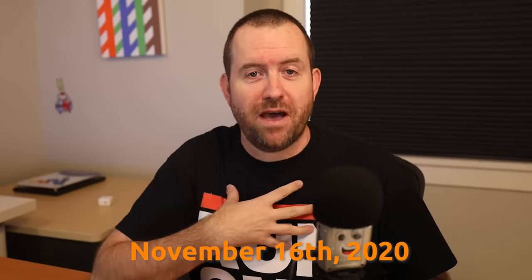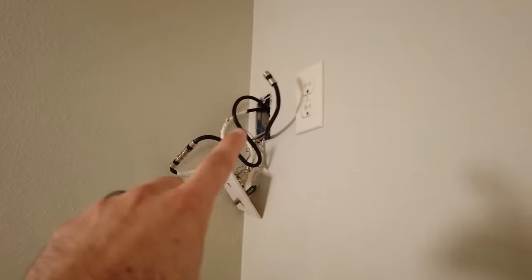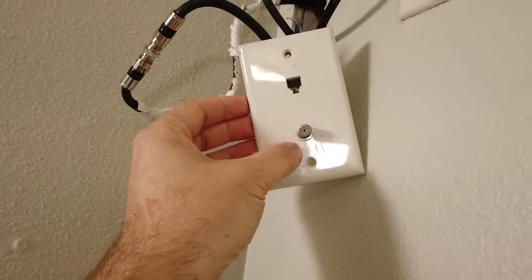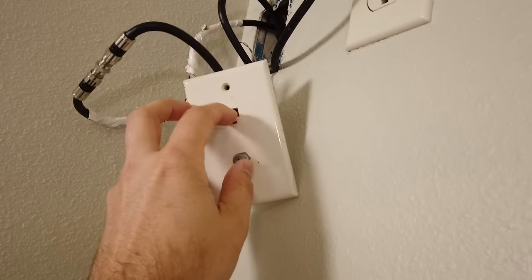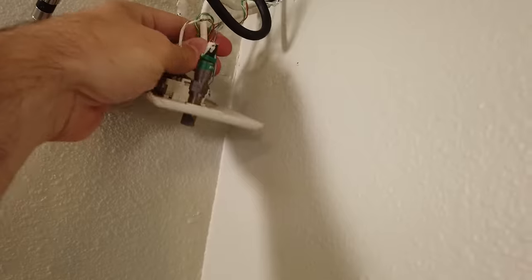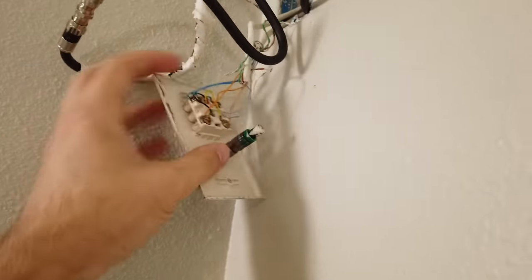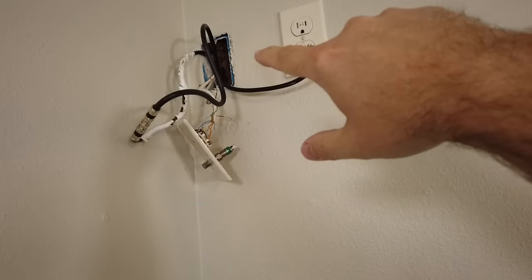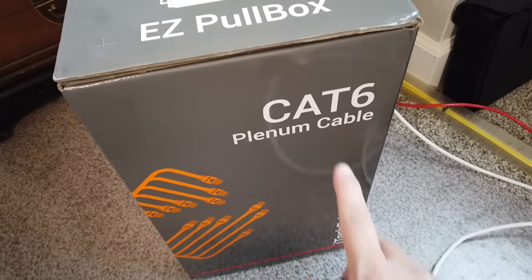Many, many mistakes were made. Rather than make you watch all these painful lessons, I'll do a voice-over and cover everything I learned. The first area I wanted to run Cat6 cables was in the corner of my office - I wanted two Cat6 cables from the floor up to an unused electrical box near the ceiling, for an office camera and a spare connection for testing equipment or access points. I started by opening the box at the top, which had one coax and one RJ11 phone connection. I clipped both out and drilled a hole at the bottom. Being that this is an exterior wall filled with insulation, I couldn't get the camera very far up into the hole.